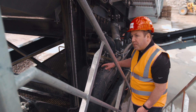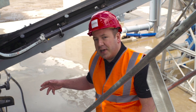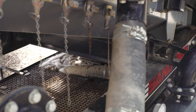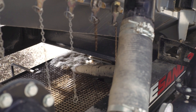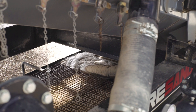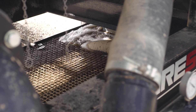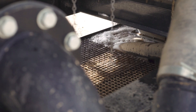Within this collection sump there are protective mats to make sure no oversized material can make its way through the pumps and cause damage — these are rubber mats located at the far side of the tank underneath the water. Also within the tank there's a float system that allows you to bring some of the cyclone overflow water back down into the tank. The float acts like a ball cock to ensure the water level in the tank remains constant and reduces the risk of the pumps running dry should there be a shortage of water.